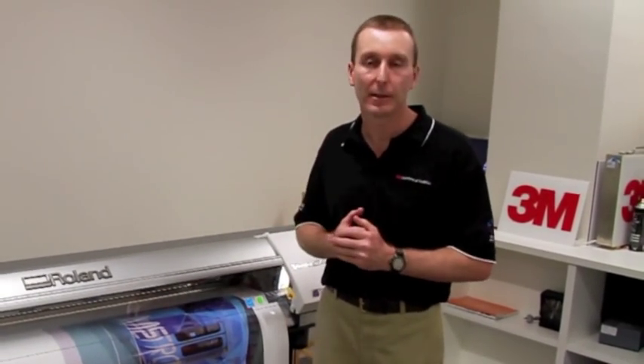Run those tests every few hours until the print is fully cured, and then you'll know — in your environmental conditions, with your inks and your setup — whether your prints take 24, 36, or 48 hours to fully cure. Print curing is a very important part of your printing process if you're running a solvent-based printer.